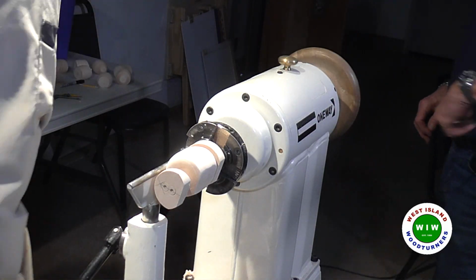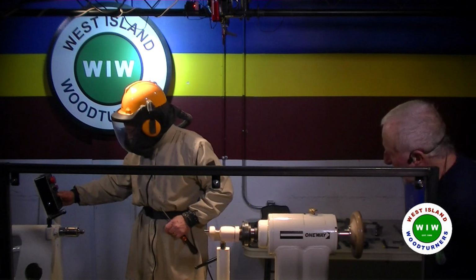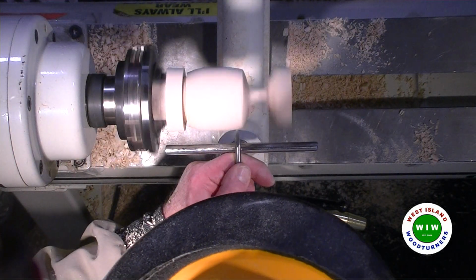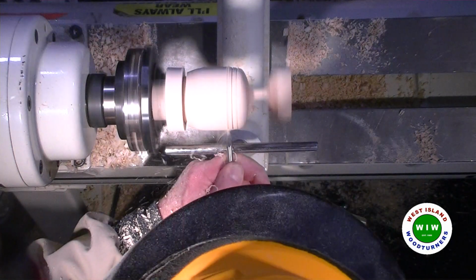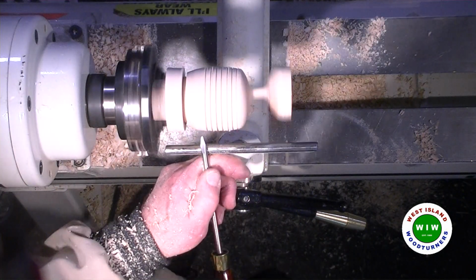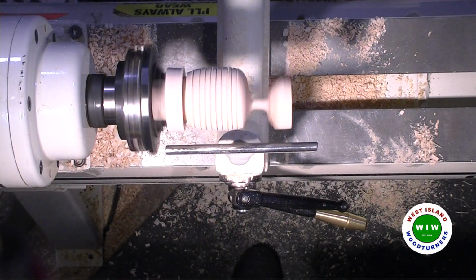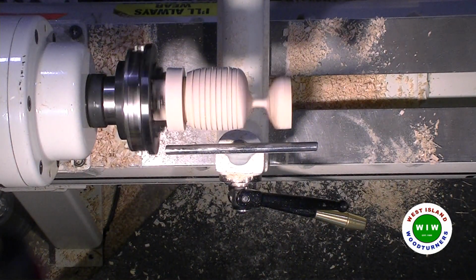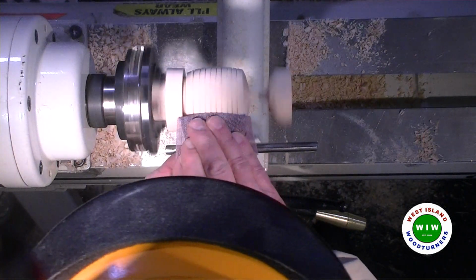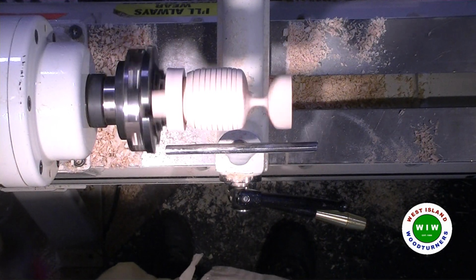He is now going to put in the decorative grooves. Now what we're using is a little detailed gouge here. This is a tri-point. If you're brave, you can do it by skewing the toe down and just cut. The annoying thing about those detailers is they do rip, whereas a skew will cut. A skew will give you a cleaner V groove.